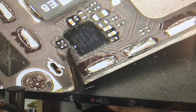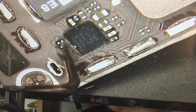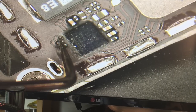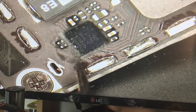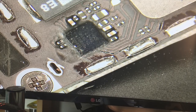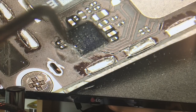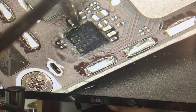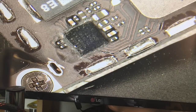And that repair is really difficult, because the U2 shares a border with the actual CPU in the iPhone 5. That's a challenge, because if you use too much heat, that spreads over to the CPU through the board. If you get it too hot, then the little solder balls that are trapped in the underfill under the CPU chip will swell and not have any place to go. That's not a good situation. So it's really easy to just totally fry the board completely.